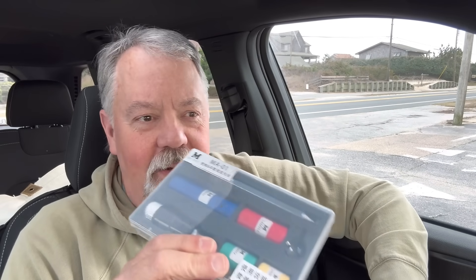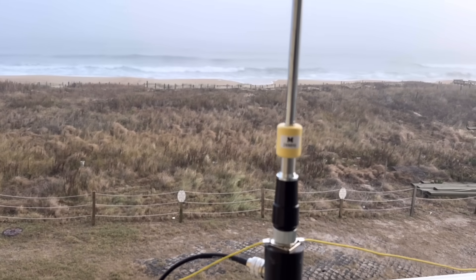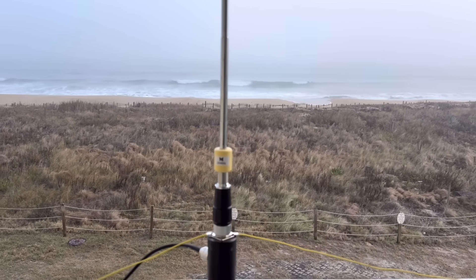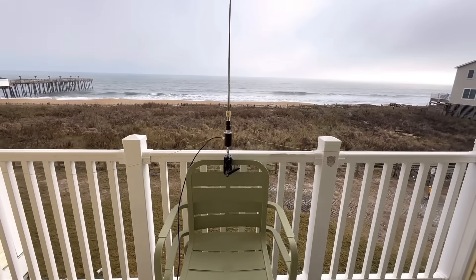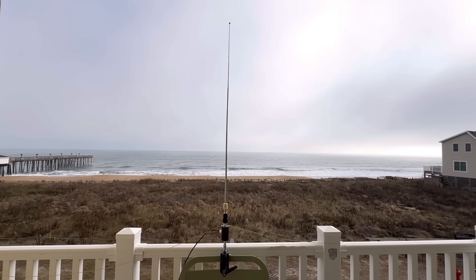So there you go — I found something that worked. Did it work well? Band conditions were probably — they were great on 10, to be honest with you. On 20, the only thing I could hear and the only thing that was going on for me was that Bermuda station, and look, I'm basically looking out the window at Bermuda on 20. And let's be honest — that thing on 10 was less coil and a whole lot more antenna, so a lot more efficient on the 10-meter band. I love talking to the guys over in Bermuda on 20. On 10, I could have sat there all day and just made contacts. It was pretty cool.